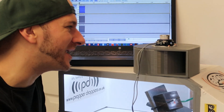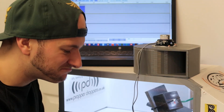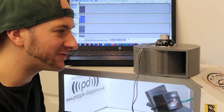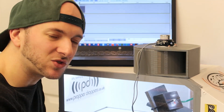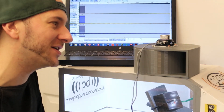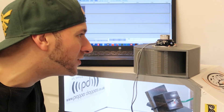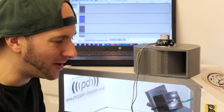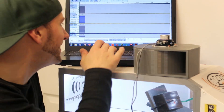The harmonics are there straight away on this one — bloody hell. Loads of mechanical excursion at this 150 Hz lowest frequency. A little bit of displacement but not absolutely loads, and we reach mechanical limits with about 2 or 3 watts on the wattmeter. Next frequency up — similar story, still not that clean and we've got a lot of mechanical noise. This driver I've had to run inverted because the hole was too small on the STL that was sent over, but it does work inverted. It's a noisy basket and motor setup — tiny little neomagnets, so it's a little noisy on the back end, and still not that much displacement out of the opening.